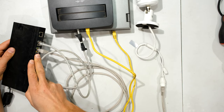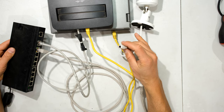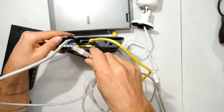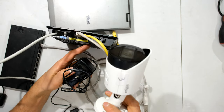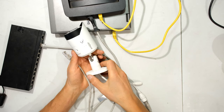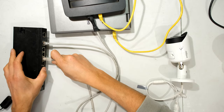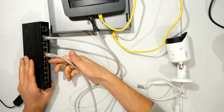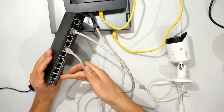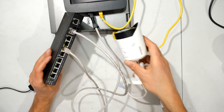Remember that the camera is already connected to the switch. If you are powering your camera via DC from another source, you can plug your camera directly into your router since it gets power from its own power source. Many people have more than one camera — all you would do is plug each camera into your power over ethernet switch. You're limited only by how many ports you have; an eight-port PoE switch supports eight standalone cameras.